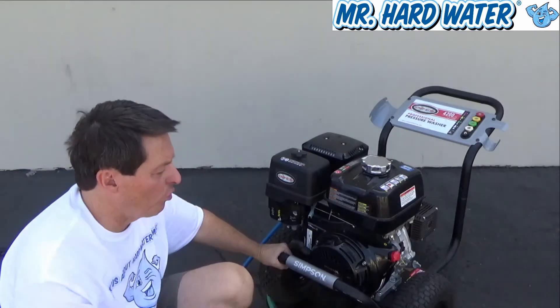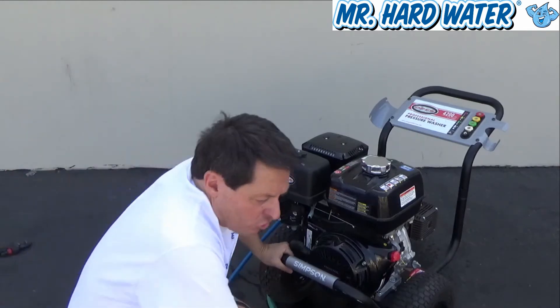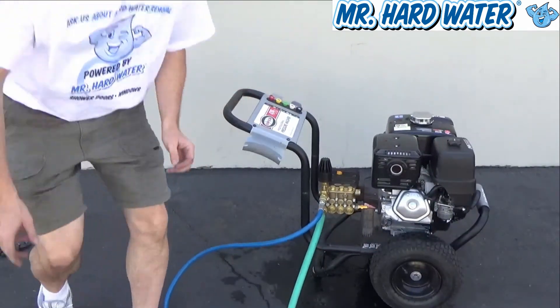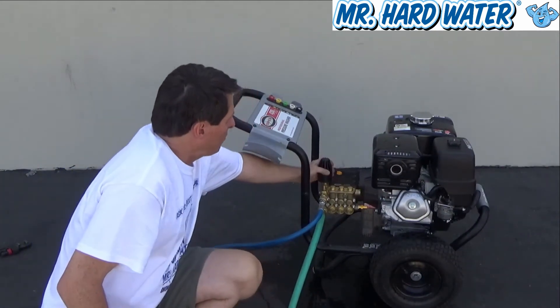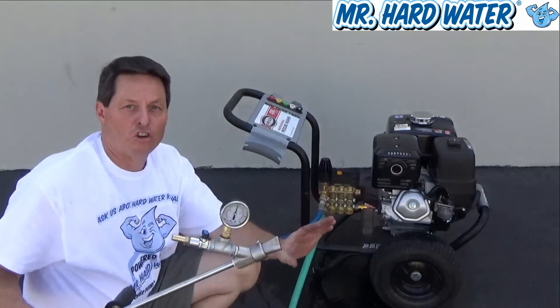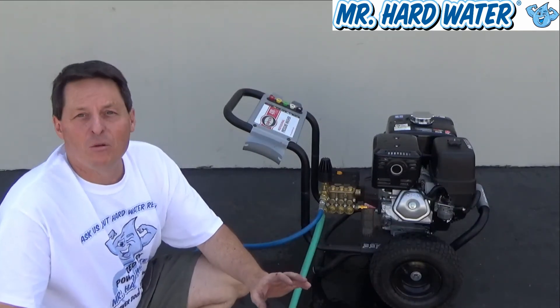There is one more thing to learn about this system: on the backside here, there is a pressure knob that we can use to adjust the pressure up or down. I'm going to spin this pressure washer around, turn the machine back on, and get a feel for the pressure. You can see this black knob here — that's our pressure knob that allows us to turn the pressure up or down. Right now it's fully open, and I'm going to turn it counterclockwise as the motor's running to turn the pressure down, and we should be able to see the pressure drop. Generally in operation, I would have an inline pressure gauge here so I could really see what's going on, and I describe that in more detail in subsequent videos.